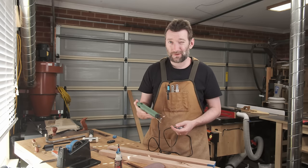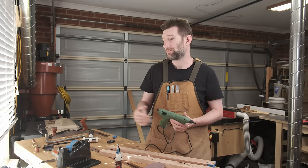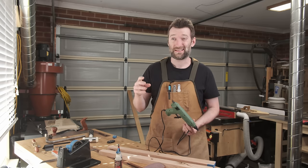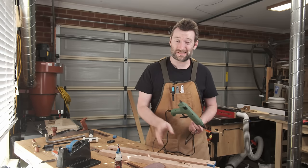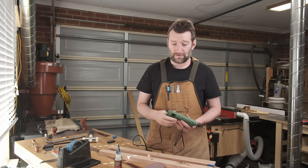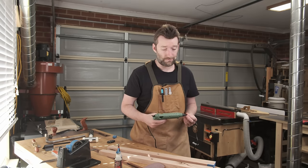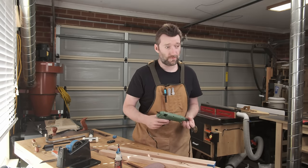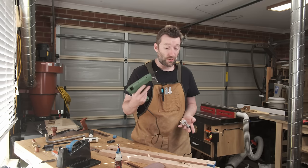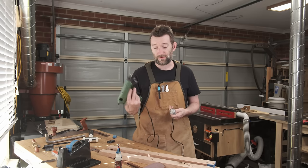They are more or less hot glue, but it dries a fair bit harder than regular hot glue, meaning you can sand and scrape and plane it much easier. Hot glue tends to be a little bit gummy, so when you're sanding it back you won't get a nice finish. It's not a cheap system to get into, but it comes in a range of colours for filling various voids and repairing wood. I 100% intend to use it only for filling voids, so we'll go through the process while I talk about whether this is a good idea.